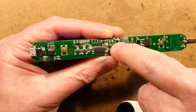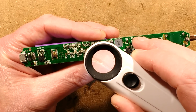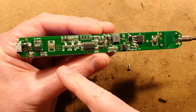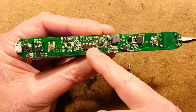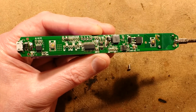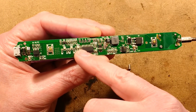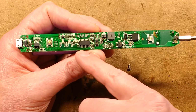This one up here is the DW01. This one here will be the, what's the 8205? It's usually the MOSFET, 8205S. It's the MOSFET. That's the battery protection circuitry there. I wonder what this transistor's for. This might be multiplexing for the LEDs, so it can control, because they're bi-colour LEDs, it might, oh no, it might not actually. Not sure about that. I would expect 2 transistors for that. I think it might literally have, because it's multi-pin LEDs here, it might actually be using 1 pin per colour.